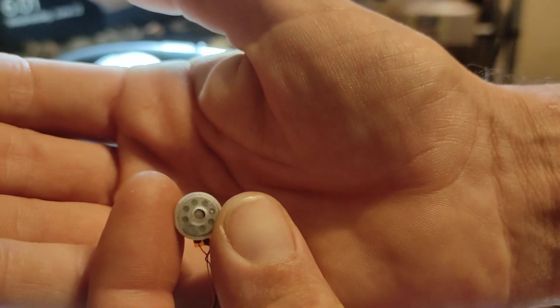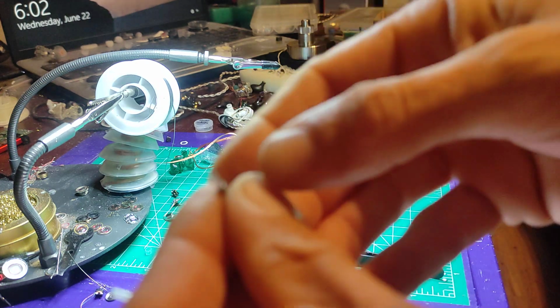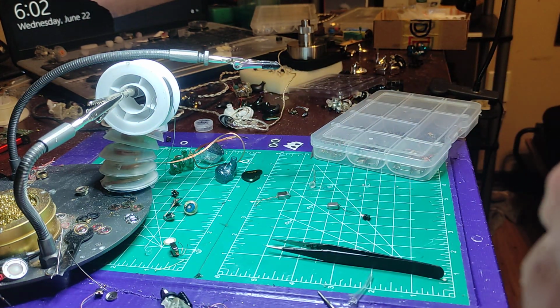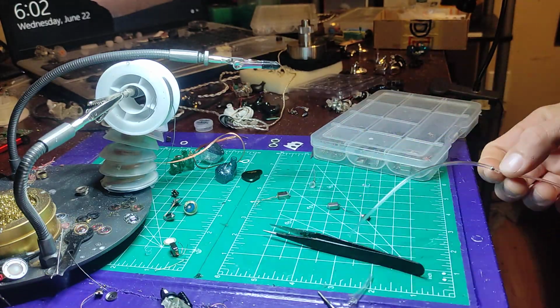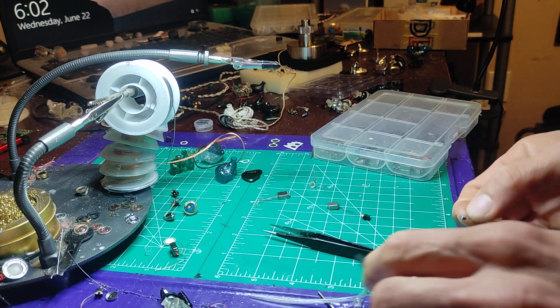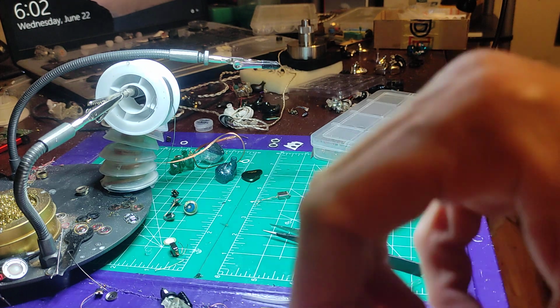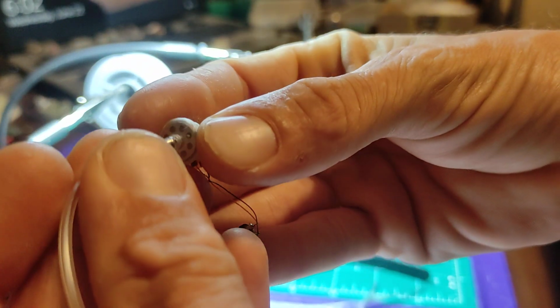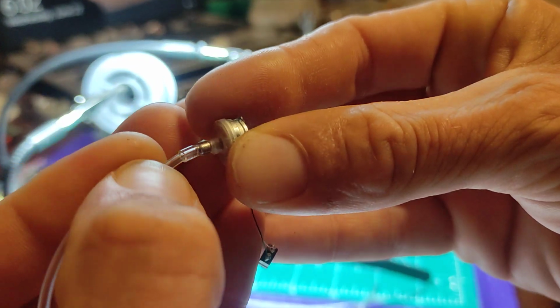So this is a cap that I make, and I do it a whole different way. Actually, I'll just show you guys this real quick because I might as well while I'm already doing this. So now what I do is I take a 1 millimeter tube, I stick it inside the 1.5 millimeter tube, and then I just cut off the end of the 1.5 millimeter tube. Okay, so it looks like that. And then this accepts the 1.5 millimeter tube just barely. Okay, just like that.